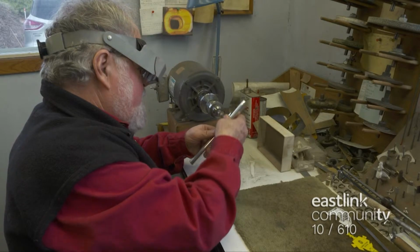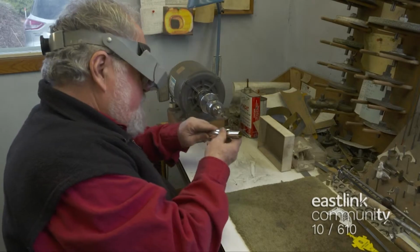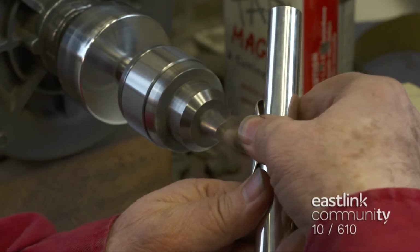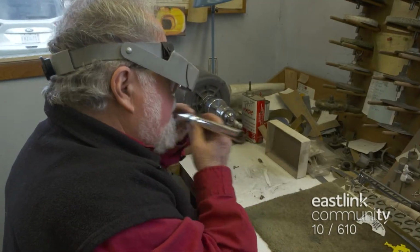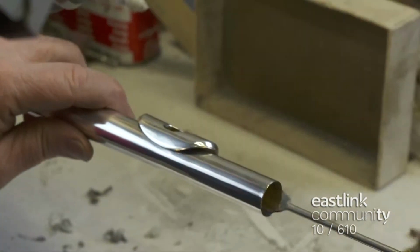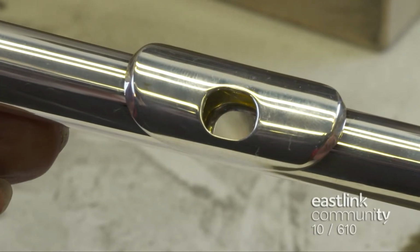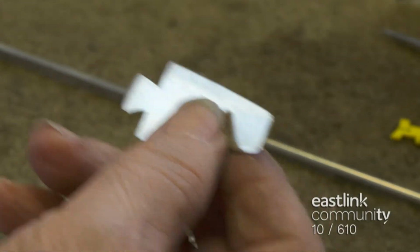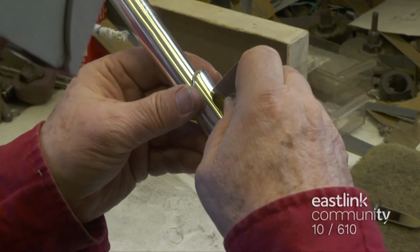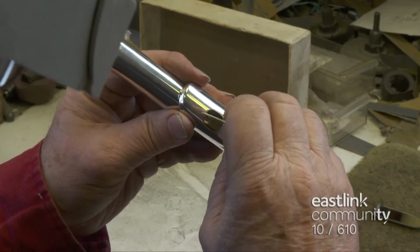Every part of the flute is important, but the lip plate and the embouchure hole are where the magic starts. The embouchure hole begins with a pilot hole. Then the flute maker pushes the drill through the silver. Through a series of intricate steps, the hole is created with exact precision for peak performance acoustics. Using a mirror inserted into the tube, the flute maker checks the inside of the tube. A master gauge measures the angles of the undercut on the front and back, the angles of all the curves, and depth. Once he is assured it fits every gauge, it's time to finish the assembly of the head joint.